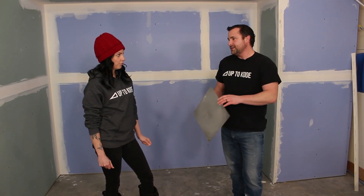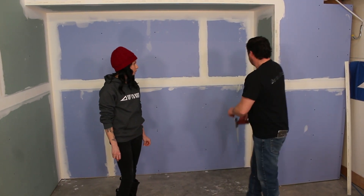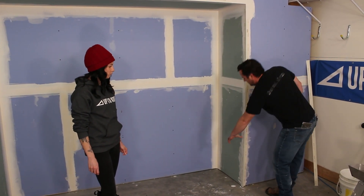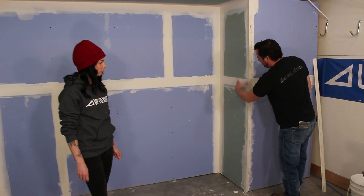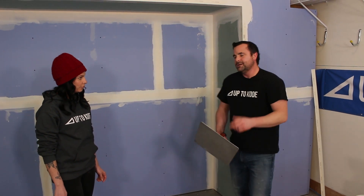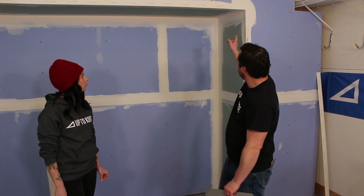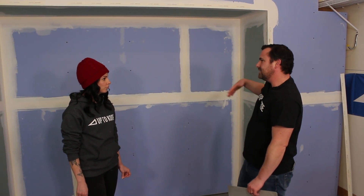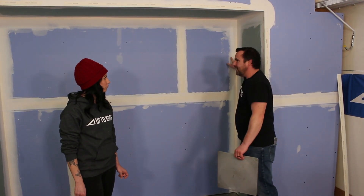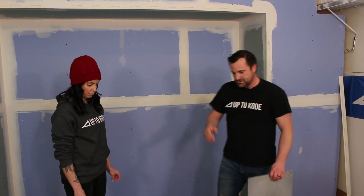So the order of taping — just this video today we're going to do butt joints, and that's going to take a while to dry. Then we'll do the flats, which will fill up the bevel and dry. Then we can do our beads so that when the beads come through it doesn't fall into the bevel. Angles are always last. For the three-way corners of the angles you only do one coat of mud, so you'll have to do one side a few days before the final coat.